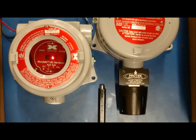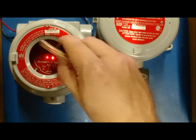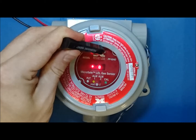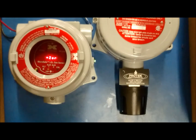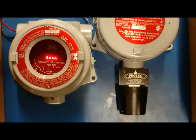We will start with zeroing the unit. Using the magnet that is supplied with the unit, hold it above the icon PGM1 at the transmitter. An arrow will pop up on the display showing that the magnet is interacting with the transmitter. The arrow will point up indicating that you are selecting PGM1. After holding the magnet over PGM1 for a few seconds, the operational display will change to the calibration menu, which will display PGM1 equals zero and PGM2 equals span going across the screen.